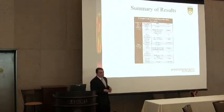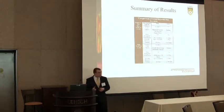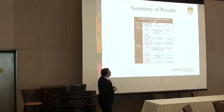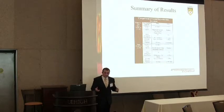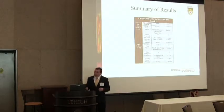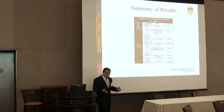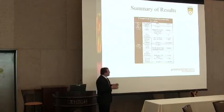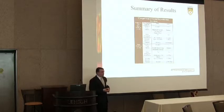There are two main technologies: unsustained pressure rejuvenation (UPR) and sustained pressure rejuvenation (SPR), with slightly varying characteristics for small and large conductors. UPR requires three visits. The first is to test the cable and do a moderate pressure injection. The second is to attach low pressure feed tanks that feed the cable for 60 to 120 days — a prolonged rejuvenation soak period. The third visit removes all equipment and returns the cable to service. Dielectric recovery takes up to two years after the soak period, and UPR carries up to a 20-year warranty.